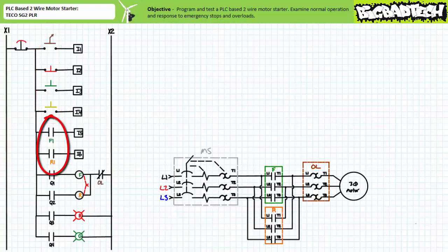The first four field input devices are intended for human-initiated interaction with our system, whereas the auxiliary contacts on inputs 5 and 6 serve as feedback about the status of a particular contactor. Note the maintained contact normally closed e-stop is not a direct input to the PLC, but rather serves as a hardwired bottleneck through which all six field input devices immediately downstream of it must negotiate to issue input to the PLC. Wired in this fashion, the hardwired e-stop effectively severs all incoming communication with the outside world without the necessity of resorting to any programmed instructions to do so.